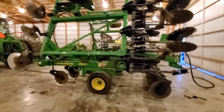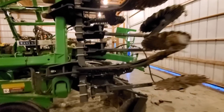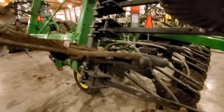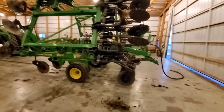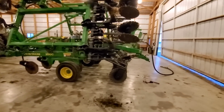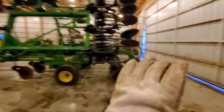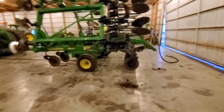All said and done, we'll have a 12-knife toolbar, probably this one with the individual coulters. We're going to use the C-knife mounts and buy B33 mole knives with the dry tube on them. I'll have to upsize that tube and drill the holes through it for the airlock releases, because there isn't a knife made besides the John Deere one. I don't like the John Deere knife — a standard mole knife is far superior in my opinion and pulls quite a bit easier. We're going to have a 12-knife toolbar with a 1910 cart capable of holding 9 tons of fertilizer, and it will be a dual-placement machine.